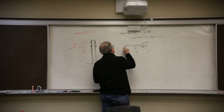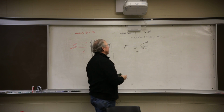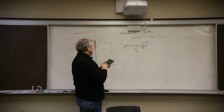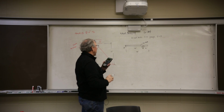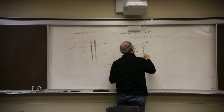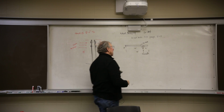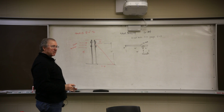I'll put it, this is G for ground, S for strut. If I wanted the value of S, I would take 20 times 14 times 7 and divide it by 12. That's 163.33, and a bunch of threes, pounds per foot. That's what you've done, okay? Okay, this is what they've done.